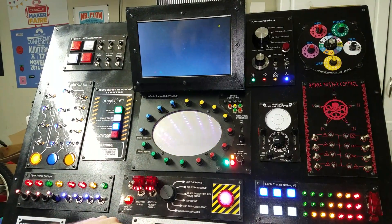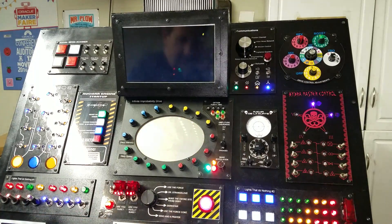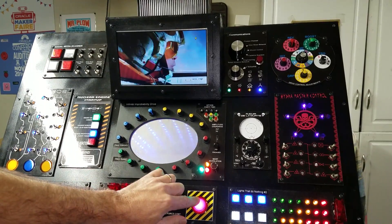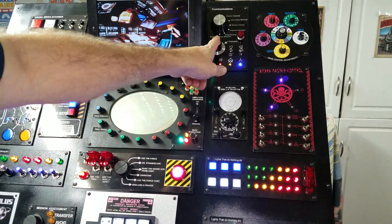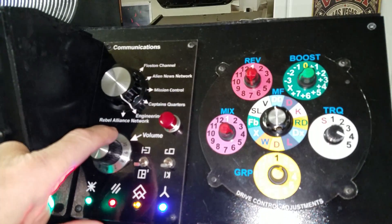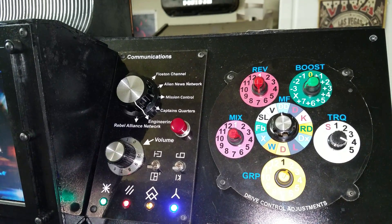There's a creepy smoking guy I found on the web — I couldn't come up with something for that panel so I just stuck him in there. And then Empire Strikes Back. This is an amplifier I got from Adafruit behind it, and then a rotary switch. Each position is connected to a different GPIO. So when I change it and push the button, the Pi reads whichever GPIO is high or low, and that's how it knows to change the movie clip.